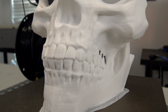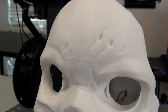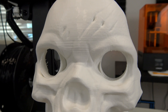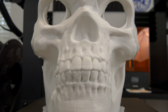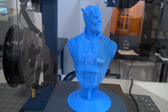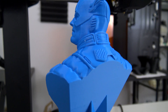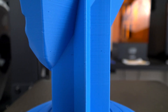This skull mask shows much less Z-wobble than the dice tower, due to being on a more solid surface. There are a few areas, like between the eyes, that show some extrusion inconsistencies, but the rest of the print is very nice. The overhang on the cheeks is particularly impressive and shows off the power of the print cooling fan. Looking at one more example, this Captain America bust turned out good but not perfect. The overhangs are great and the smooth sloping sections on the sides and back are consistent. However, there are small dots of missing plastic scattered throughout the print, which might be from retraction settings needing further tuning.